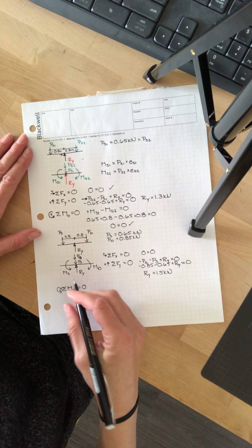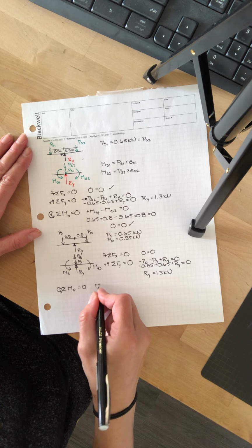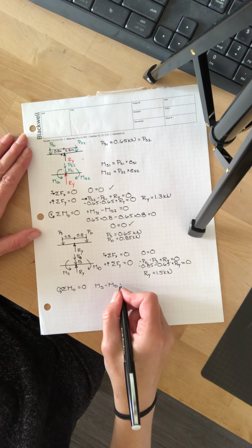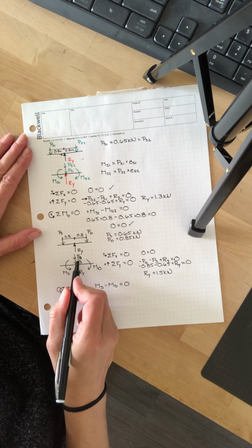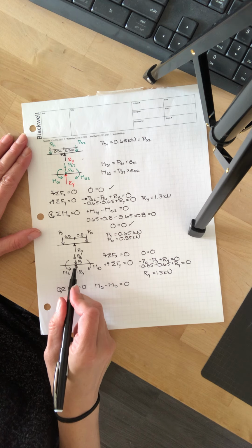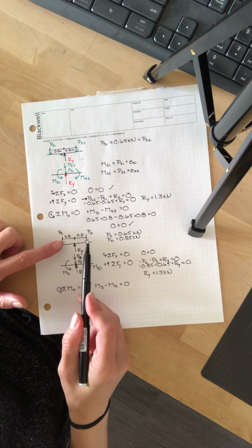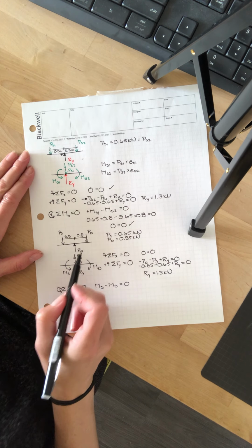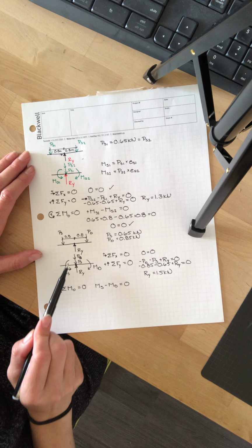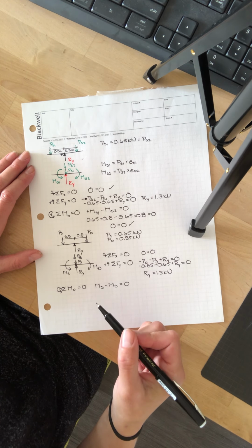So we have the moment due to Shannon in the positive direction, and the moment due to Dave in the negative direction. The weight of Shannon and the weight of Dave and the reaction all go through the centroid. Now people are probably saying, wait, no, those were over here. Except we know that a force through the centroid and a moment about the centroid is the same thing as a force some distance from the centroid.